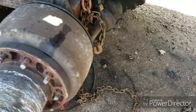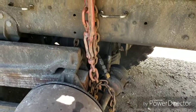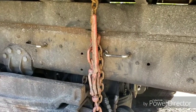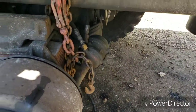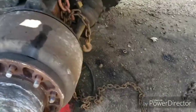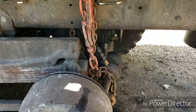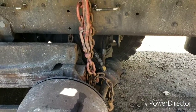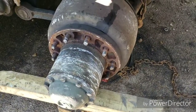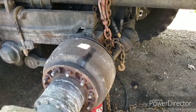The chain routing is the same way — up over the frame, down under that bolt — which keeps it from walking. You'll put your binder on there; the binder will have to go up because there's not enough room to go down. I always put the binder around the frame so it can't move too much. If you don't have a chain to wrap the lever-lock locker, always use zip ties to lock them off. This method uses a lot more chain — if that's all you've got, a short chain works pretty good. About seven and a half feet is what it takes to do it. Jack up as high as you can, put it on, level the binder up, lock it, then let the air out of your jack.